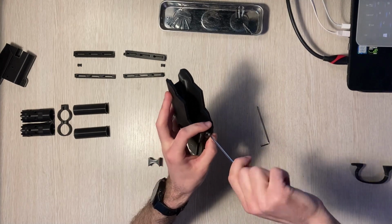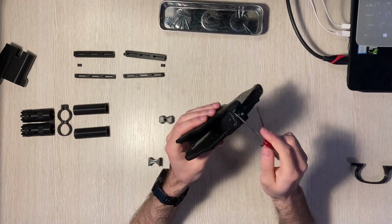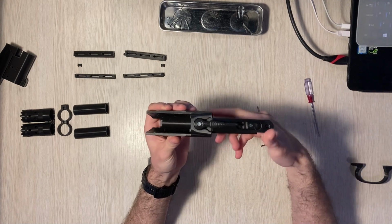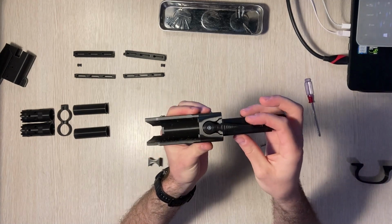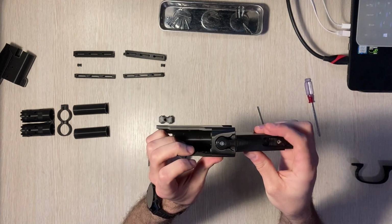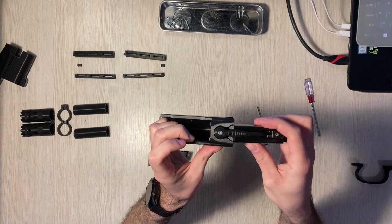Do not over tighten it, because if you over tighten this, it will block the lever. Also, it will protrude in the spring chamber here. So make sure again everything is working fine. Check the lever. As you move the lever left or right, this latch should retract to the breech. Also, the lever should spring back if you let it loose.